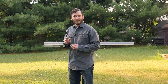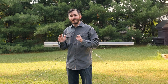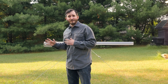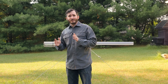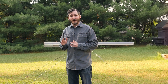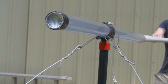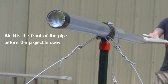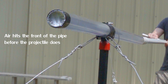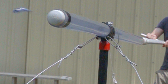As I talked about in my earlier video, the force I'm relying on to open the valve before the projectile hits it is the remaining air in the vacuum cannon that was in front of the piston before I pulled it back to draw a vacuum. It's not a total vacuum — it's just very, very low pressure. So when the vacuum refills with atmospheric pressure, there's already some air in front of the projectile, and it's that air that I'm relying on to push the valve out of the way before the projectile hits it.